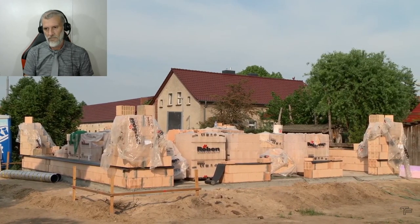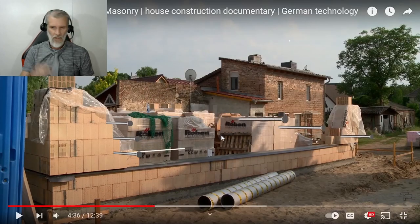Forming the corners has the advantage that you can easily lay. Okay, so for the first day of block laying, I would say that they've done a lot of work. It doesn't look like they've done much there, but those first two courses, they spent a lot of time on them, making sure that they're all perfectly square, and that membrane, which is probably the most important thing to stop that rising damp coming up through the walls. But yeah, now that they've got all the corner blocks in, it's day two, they should fill. They'll be up to the first wall.